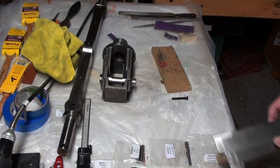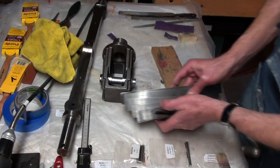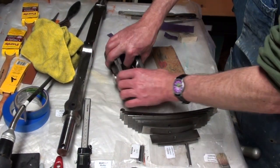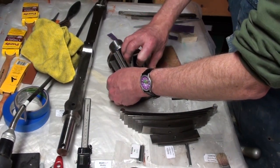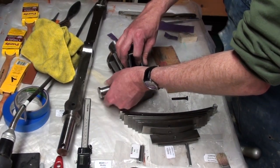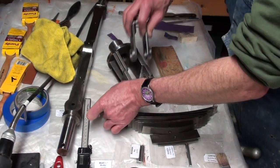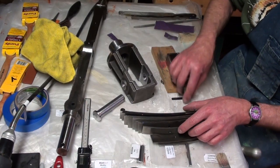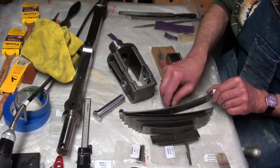The individual leaves of the leaf spring were assembled to the spring hanger with a long screw. The screw was tightened completely. For the test fitting, this screw was left long. Once the leaves were painted and lined, the screw was tightened one last time, then cut short to allow the assembly to fit into the pivot casting without the screw interfering with the casting.